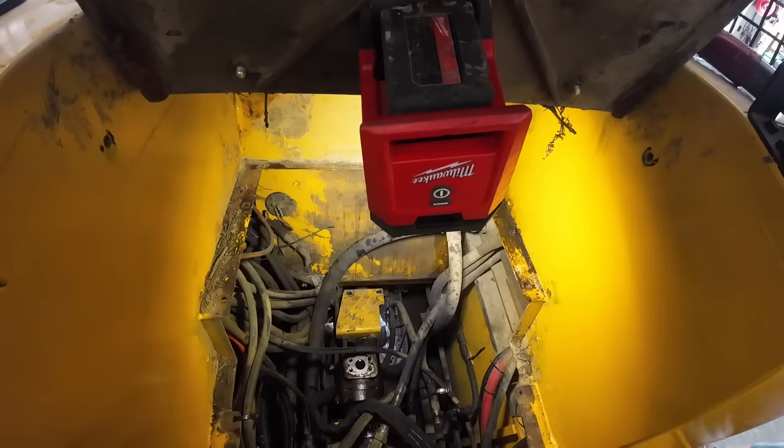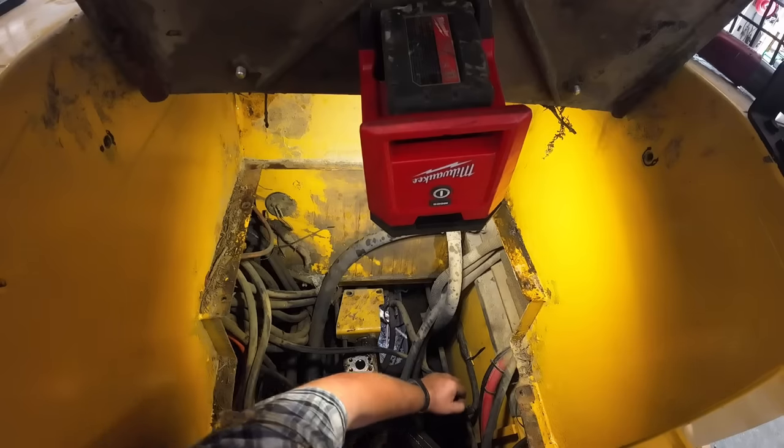He's coming for scooping. That's our vacuum on the transmission tank right now, because we will have oil come out of the back of this last transmission pump right here. So there's a little plug, and it'll shoot a stream out like a 3/8 stream if you don't do that. And we're probably just gonna manhandle this pump out by hand.